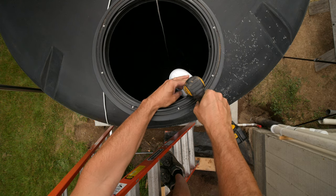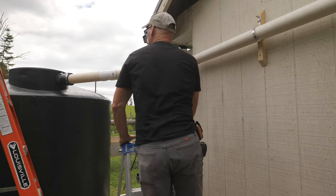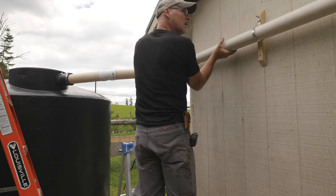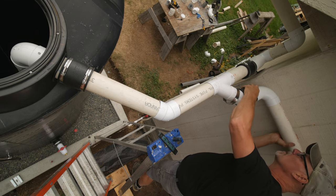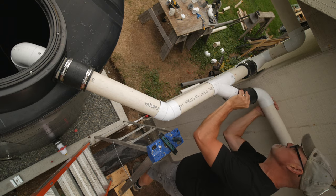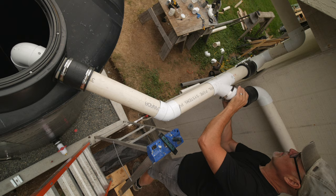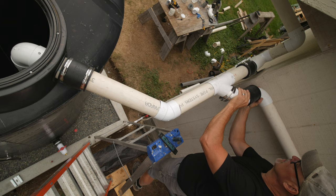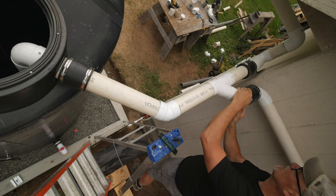I'll attach these with a stainless steel screw instead of permanently gluing them. For a lot of the sections of the plumbing here, I tried to think about having to disassemble things later, so I only glued what I really needed to. I like these 3 inch flexible rubber couplings with the two screw clamps — they are great for quickly taking sections apart, and to manage tough connection points or those that require some flexibility. With my limited plumbing experience I need all the help I can get. I made an assembly of pipe with a Y to finally connect the pipes from both sides of the building.